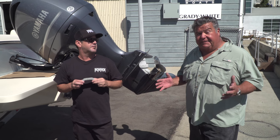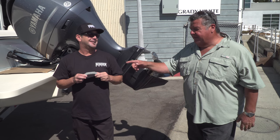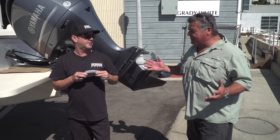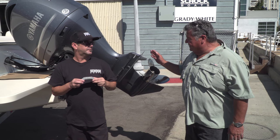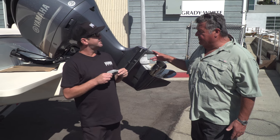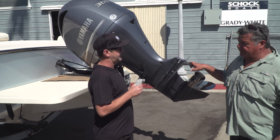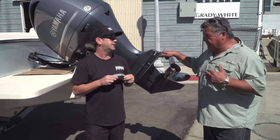This is a good safety tip. Don't try to be penny cheap and save a few bucks on your zincs — not with these. They have to be Yamaha factory parts. There are also some anodes in the power head that do some sacrificing, but the interval on those is hundreds and hundreds of hours. That's why it's important to bring your boat in for that service — preventive maintenance.